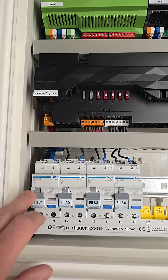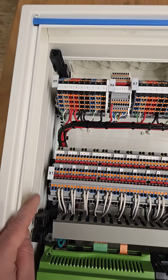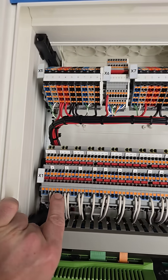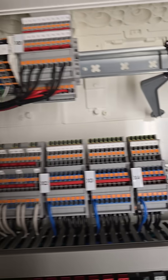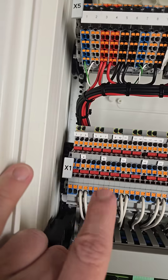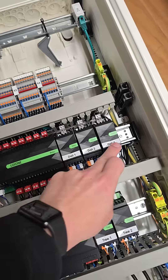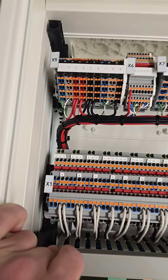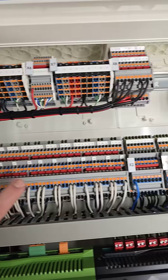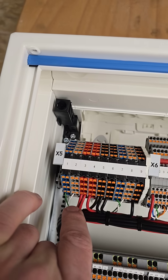The cabinet is powered with three phases and we have some breaker and RCD combinations here for the DALI lines. As always, everything was prepared to be already pre-wired on these nice terminal blocks. There is documentation so we know exactly where each cable needs to be connected, especially for DALI. We have lots of DALI lines going out for living room, kitchen, and those are five-core wires.